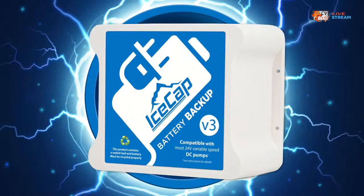Once a surge or an outage occurs, the battery backup goes into an immediate low power mode and turns on the pumps. Once the power flickers off, the battery backup just kicks right in. The amount of time the pump will run depends on how charged the battery is, how many times the battery has been discharged, and the amount of power the pump is drawing.